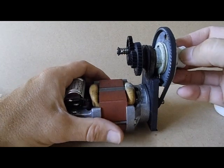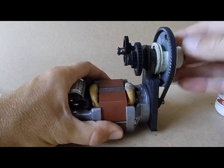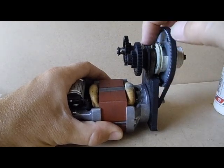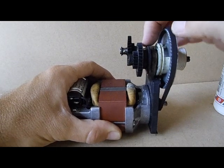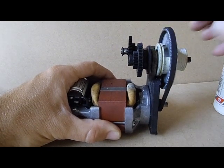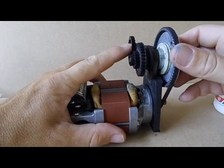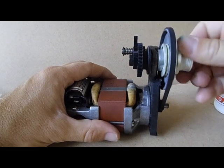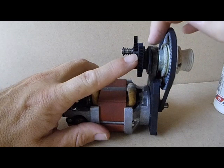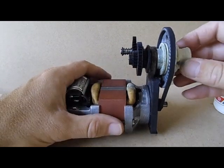I can turn it to the side and show you how it actually works. If you pull it out, this gear will disengage and run freely, and your machine belt will drive the machine from there, giving it much more speed. If you push it in, this gear will engage and run through the gears — you'll see these little gears turning much slower, driving your belt at a much slower speed. That's how it's controlled.